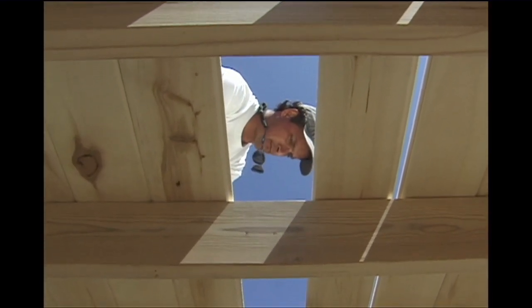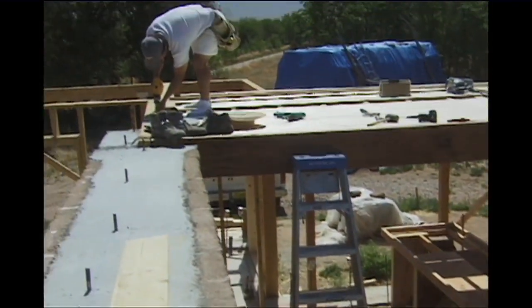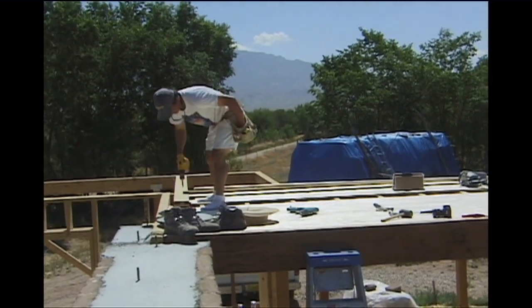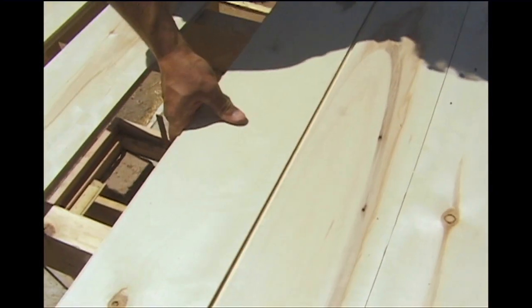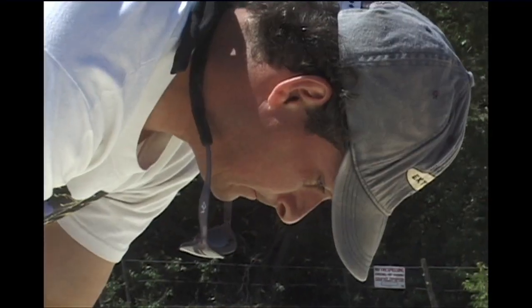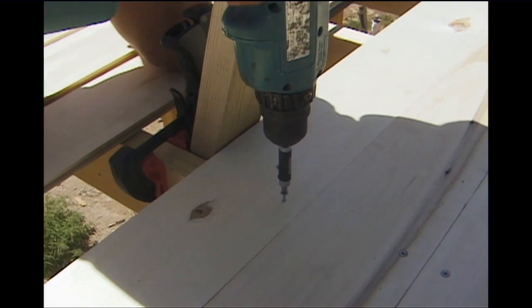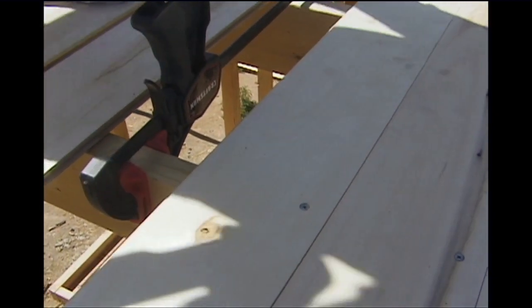The loft floor is made out of aspen wood. Aspen is fast growing and is considered more environmentally sound than pine or oak. The downside is that it's very soft, but since this is not a high traffic area, the floor will not receive a lot of wear and tear, so the softness will not be a real problem. This adds to the environmental quality of the house — we are using a wood that is appropriate for the location.